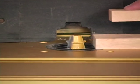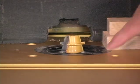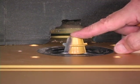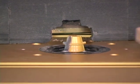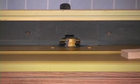Also make sure that you're hitting here. If you're hitting here, you know you're cutting on the top, and we've got carbide at the bottom. We've got it set to the right height, and both of these bits, the male and the female, are height matched. So when we change bits, we're set at the same height, and they'll coincide. Now we're going to set our fence up. Our fence will drop into our pivot point.